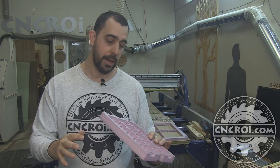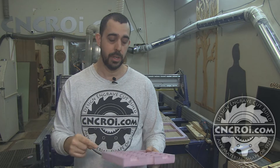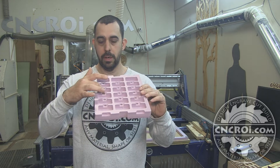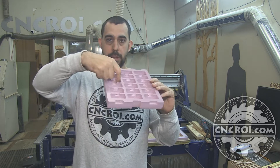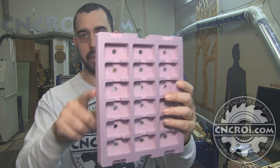The next step after that is to make all the holes you see here. For the same reason, if you do the holes first you're machining something that's kind of redundant — you've already machined out the hole, so why not just have it go a little bit faster making the final hole, rather than making a big hole first. After that you go over it and make the pocket, and the final step is actually to cut them out.